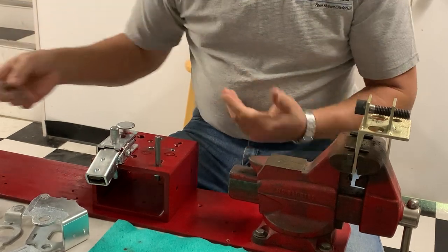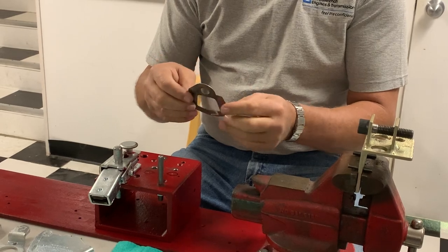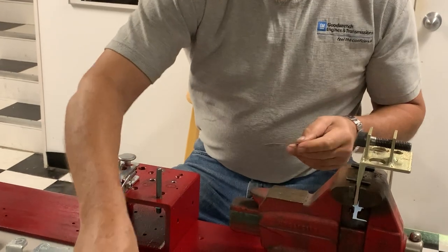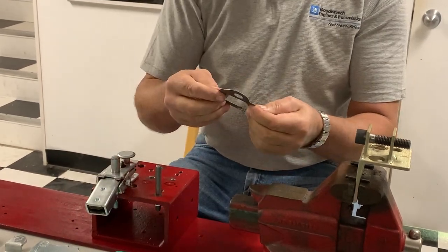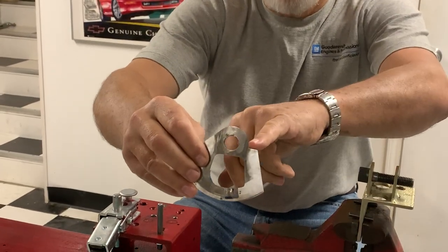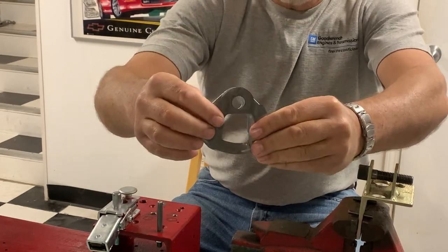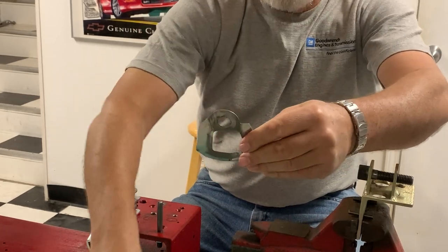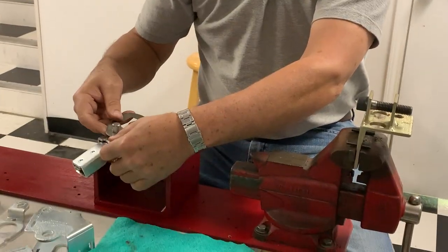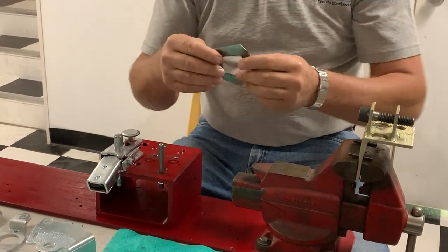Now you've got to put all your arms and plates in. First thing: there are three shims that have to go in place. The first one is the thin one — there's a little detent, a little cutout, that's not in that one. This is the first one because when the bow tie is in place there's interference, so you have to use that one first. It's the skinnier one.